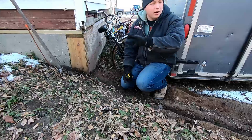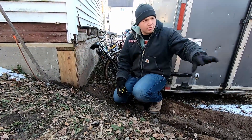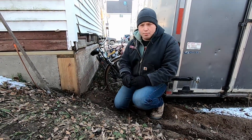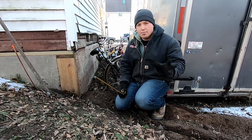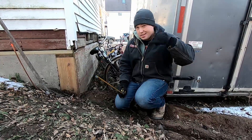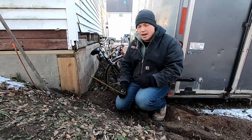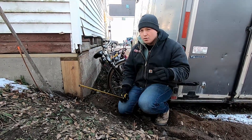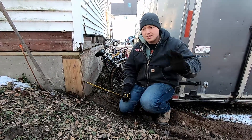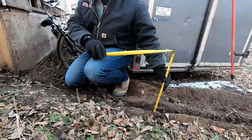In most common applications where you're just digging a trench across your yard or some untraversed space, 12 inches is going to meet code 90% of the time or maybe even more than that. Depending on where you live there may be specific codes for your area. I highly recommend giving one of the propane companies in your area a call and asking them — usually 12 inches is the minimum. The trench we dug today is set at 12 to 16 inches deep.